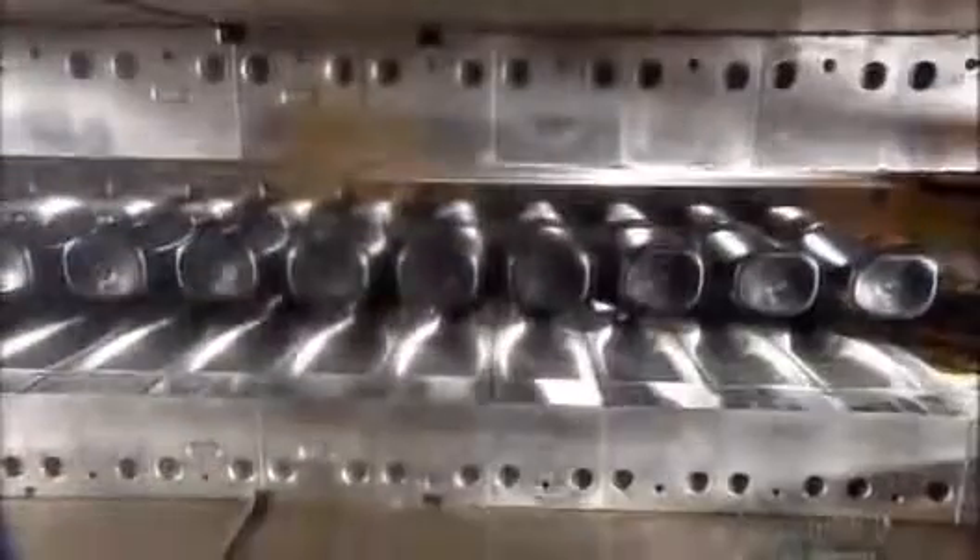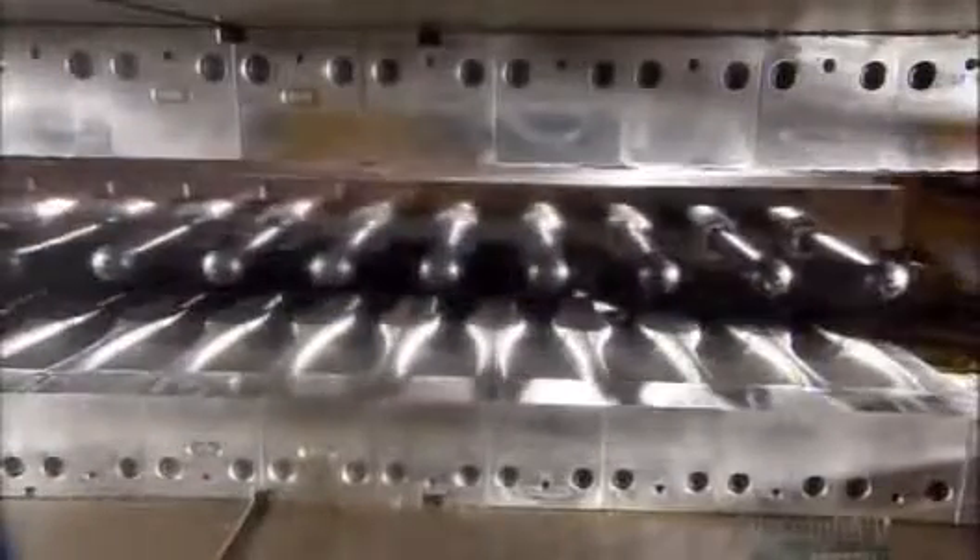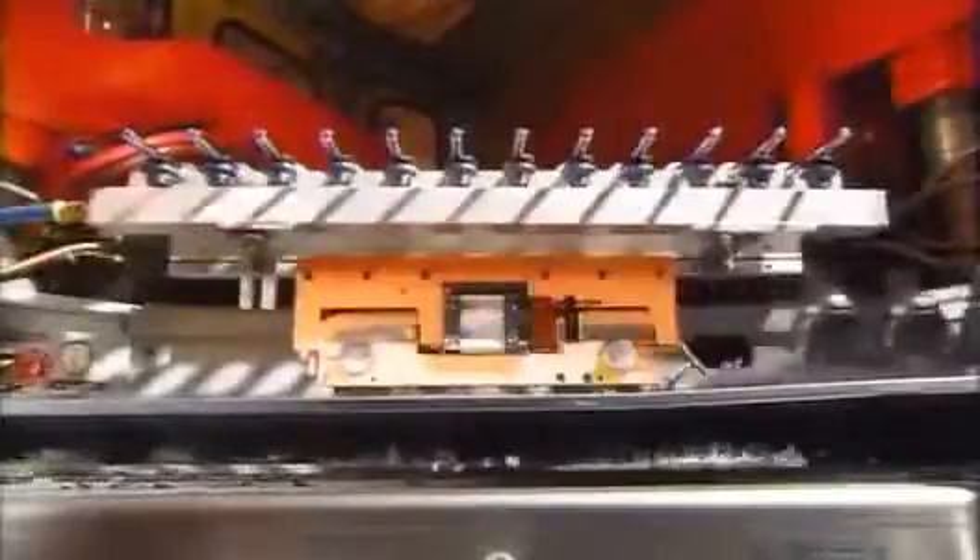There's a different packaging system for liquid shoe polish. A blow-moulding machine forces hot air into plastic to form containers. Then the mechanized rack holding the containers rotates and places the newly formed bottles on another conveyor. It moves them under a flame, which melts the rough edges. Revolving conveyors move under filling heads, which pump liquid polish into them.